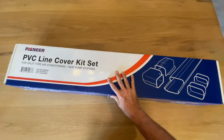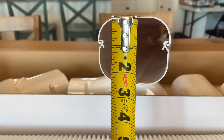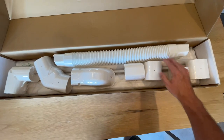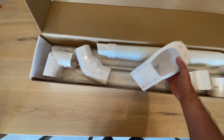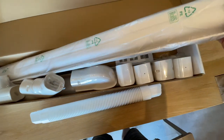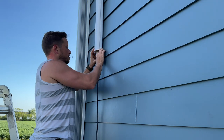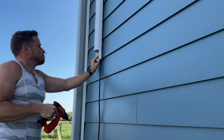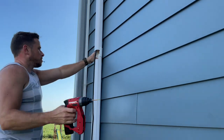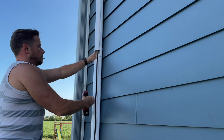I ended up going with the Pioneer PVC line cover kit. This comes in two different sizes, but all I needed was the smaller size — the three by two inch. It comes with three couplers, an end reducer piece, one wall cap, one swivel elbow, one 90-degree elbow, a flexible piece, and four straight pieces that each measure right about 39.5 inches long. One main thing I wanted to touch on was the connection point from the straight pieces to the couplers. In my other unit I only installed a single screw at the coupler, but the instructions say to drill a new hole through the straight piece and the coupler together and screw that in as well.